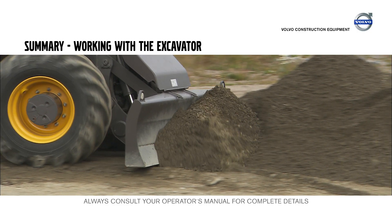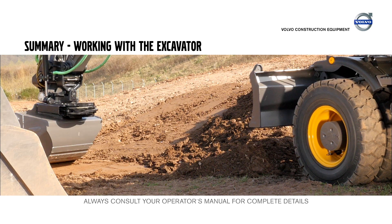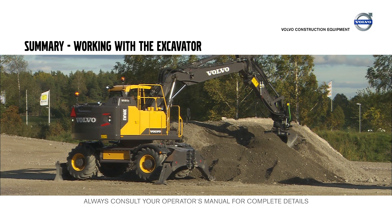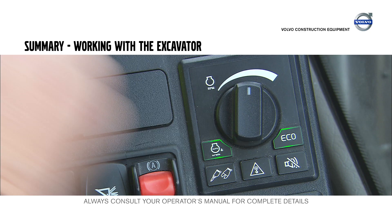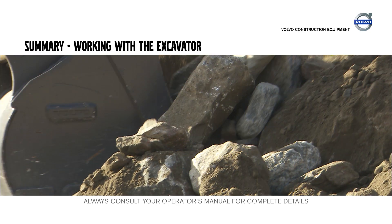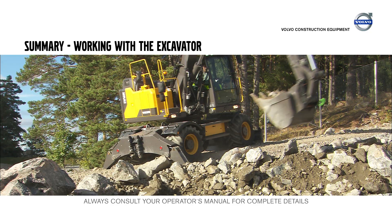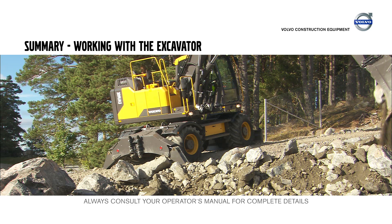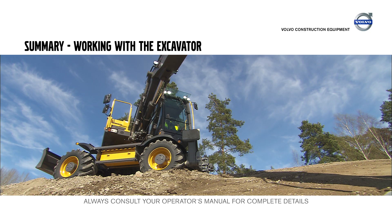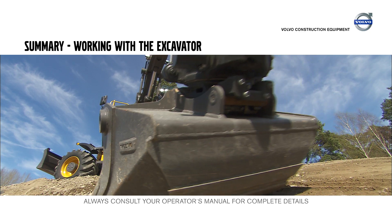Always prepare the ground and use the outriggers to achieve the highest performance. Flatten out the surface to achieve a flat working position. Always dig over the rear axle with the brake engaged. Control the engine RPM and the slew speed when digging on a slope. Handle the machine more carefully since the load can change the balance of the machine very fast, especially on a slope. Reduce the engine RPM when it comes to grading to achieve a higher degree of controllability with less power for higher productivity.